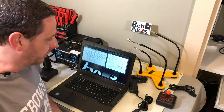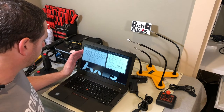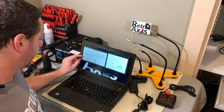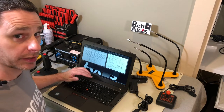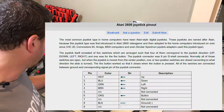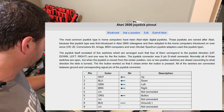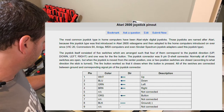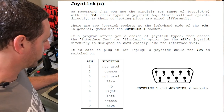Before I get into this build, it's somewhat important to plan ahead. What I've done is I've looked up the exact pinouts of an Atari joystick in terms of which pins are which, and I've done the same for the ZX Spectrum. I'm going to zoom in to demonstrate the differences. You'll note that pin one for Atari is described as the up direction, whereas on a Sinclair it says function not used.